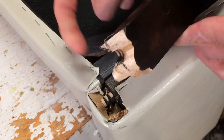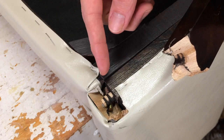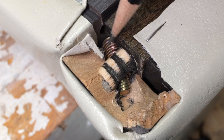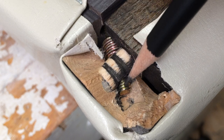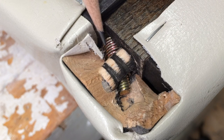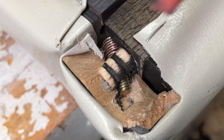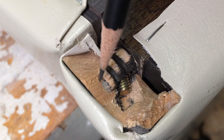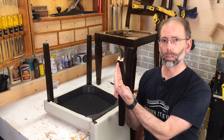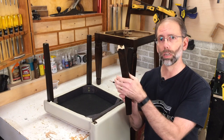This is where the leg broke off and there's a section missing — that section is the dowel that holds this piece to the leg. There's also an insert nut in there, with coarse threads that get threaded into the wood so you can thread in a bolt. A large hole was drilled to get the insert nut in, but unfortunately it was drilled really deep. So if you take that amount of wood out of this piece along with the dowel, there's not much grain holding the existing piece of wood together. The other part is the orientation of the grain — when you build a chair leg, the grain needs to be as straight as possible because that long grain provides the strength.